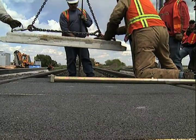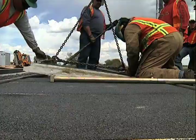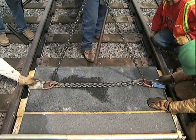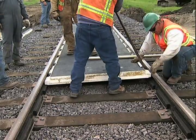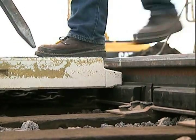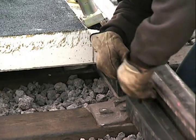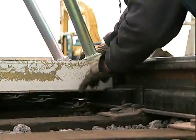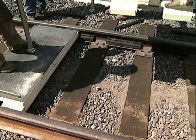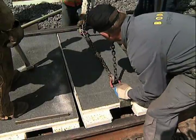Lift and place an interior panel, lowering the nose of one side of the panel first. Use the fulcrum tool provided by Transpo to compression fit the panel between the rails. After the panel is in place, slide the top section of the two-piece rubber sleeve between the panel and the rail using the panel spreader tool. Continue to place the interior panels, paying particular attention to the alignment with the rail.